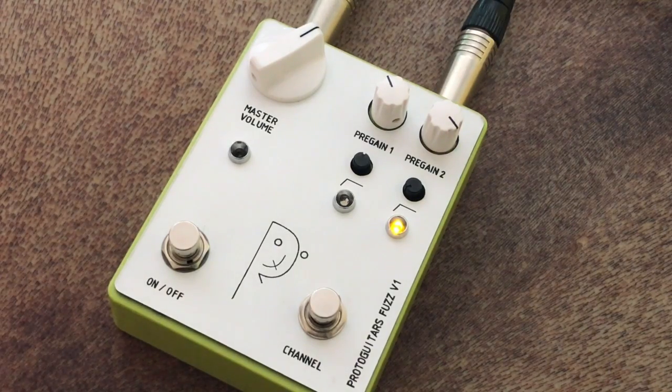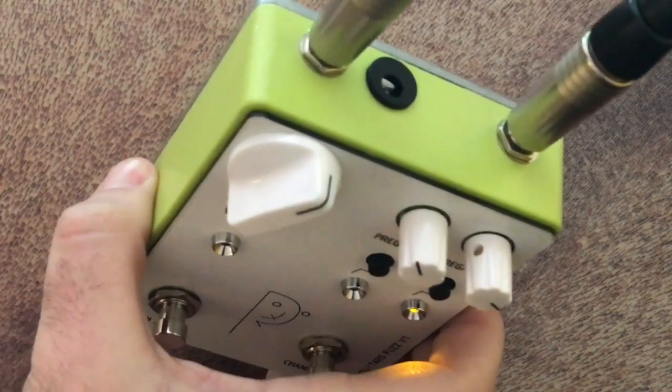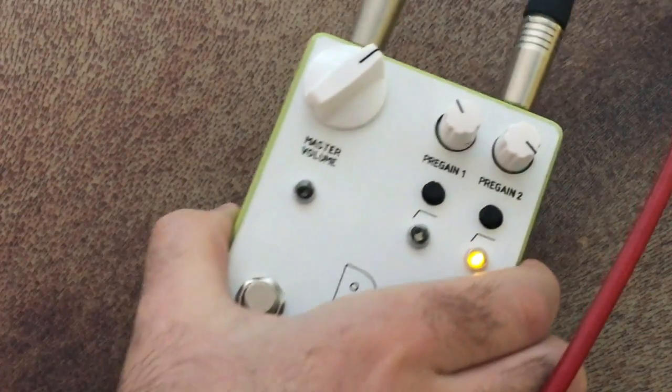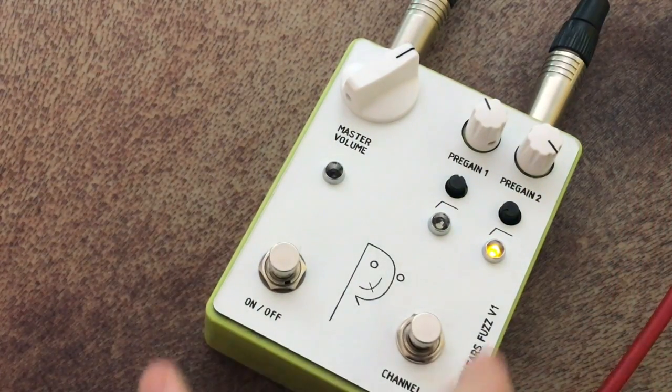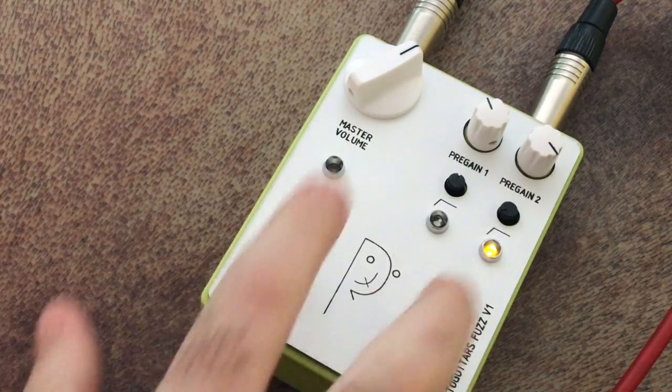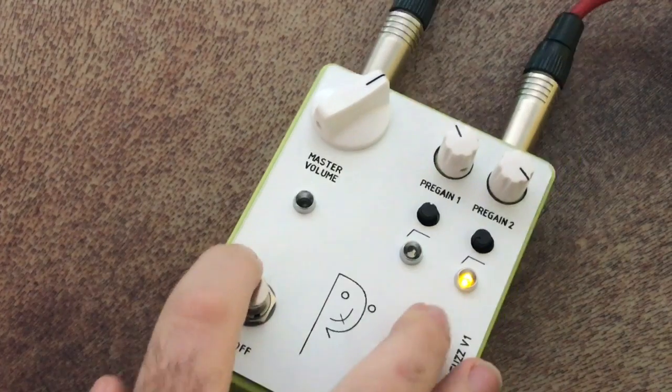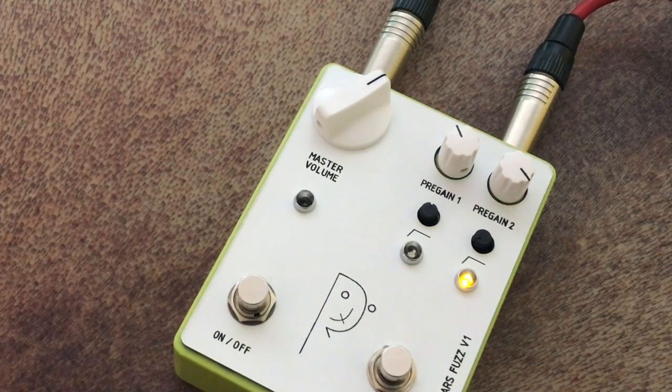And that's about it. Top jacks and top power are running on 9 volt. Sounds the same with the battery or with the plug — I've been going back and forth. The stomp switches are not attached to the circuit board, so if you break them, you could just yank them out and stick new ones in there. Same thing with the jacks — they're not board-mounted at all. The power, the in, the out, and the stomps are all separate.